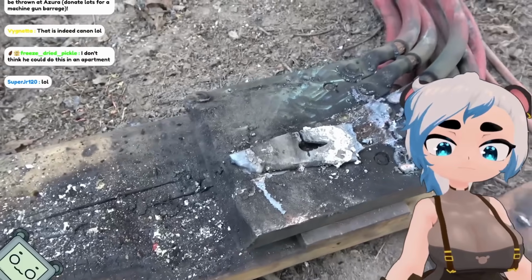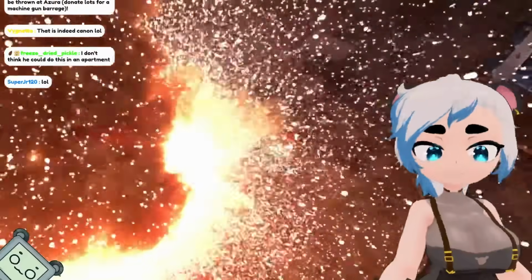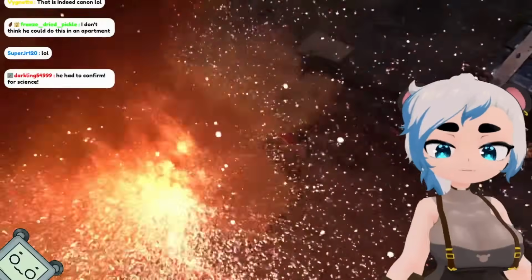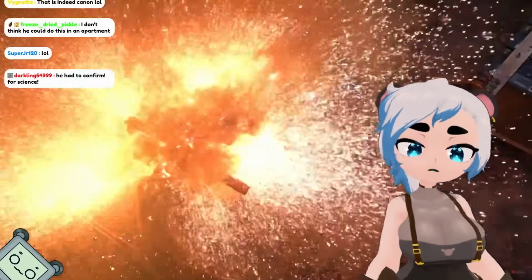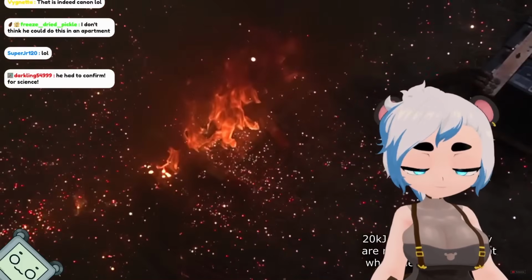It's insane. I tossed some magnets in the middle of the wire loop there, and you can see them jump once the current starts. And yeah, I put my camera way too close for this shot. Now something that sticks out to me here is when the crowbar finally burns through, and it shoots out a big plasma fireball. My bet is that inductive kickback is playing a role here.